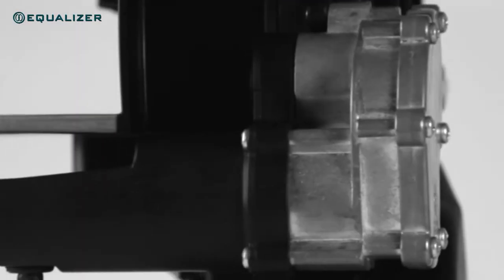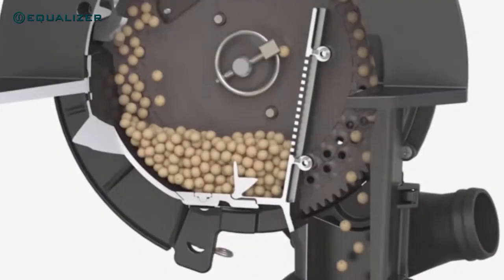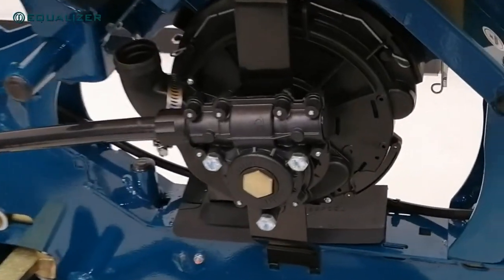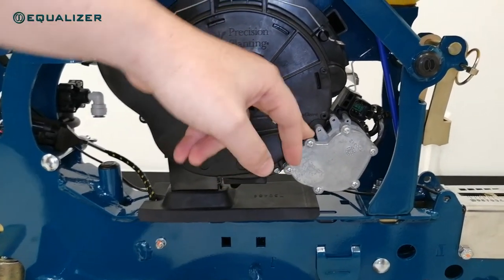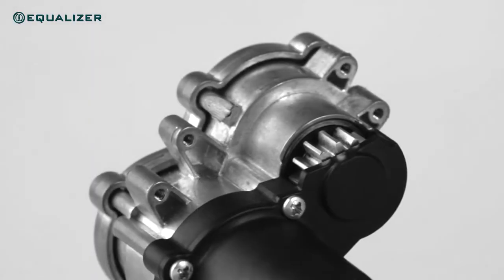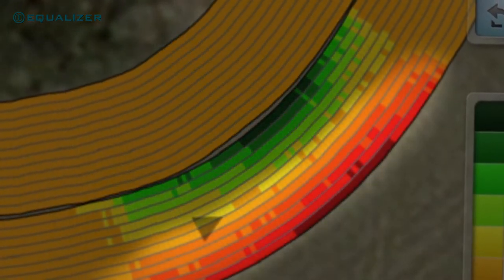The VC2 metering unit can still be equipped with any one of two drive options. The traditional ground drive system with an easily adjustable gearbox to set the seed population, and a safe maintenance-free drive cable running to each of the metering units. Then of course there is the very popular V-Drive option from Precision Planting — an electric drive motor which integrates with the 2020 system and controls each row unit individually.